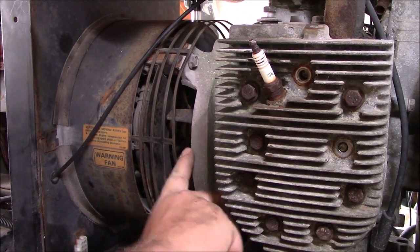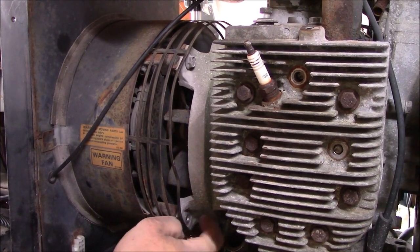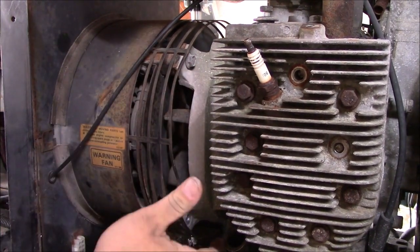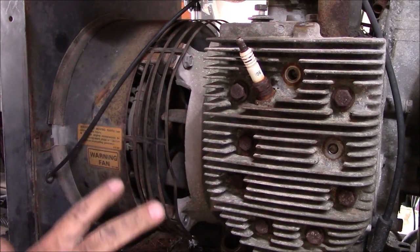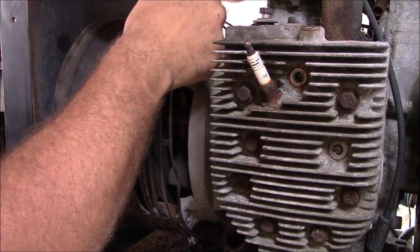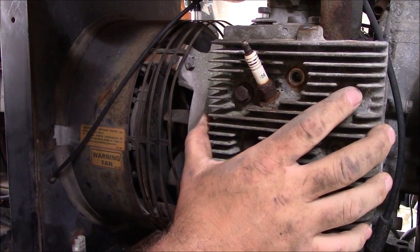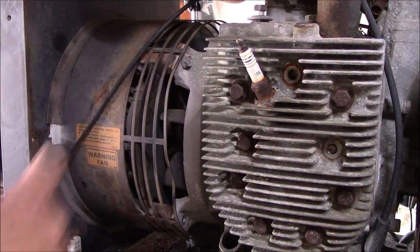There were four bolts on the back side of this fan that we took off. There's a bolt here that's out, this bolt here is still in — that's the last one — and there's two on the other side in the exact same spot. Once this one comes out, the motor should be completely disconnected. We do have to pull this cable here with a straight screwdriver, loosen that, pull it off. Then we'll set this thing on the ground and pull the motor off.